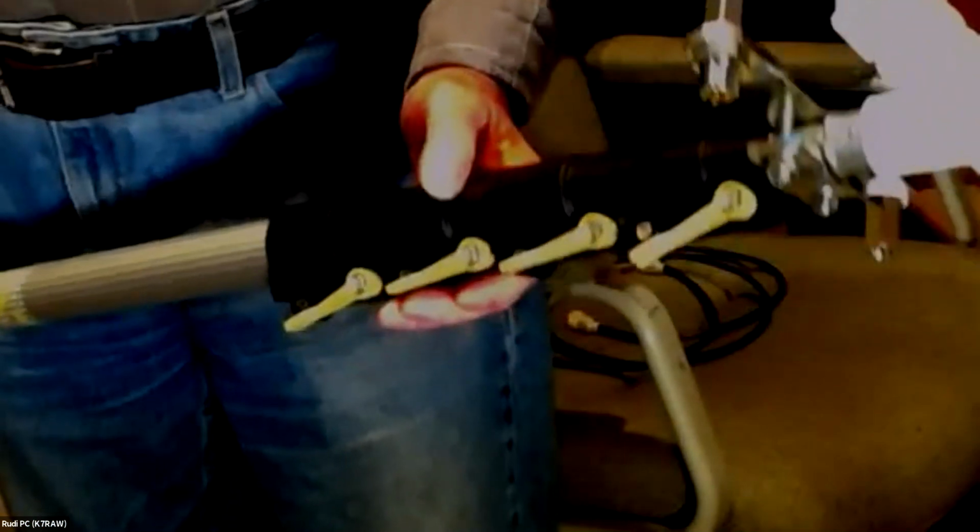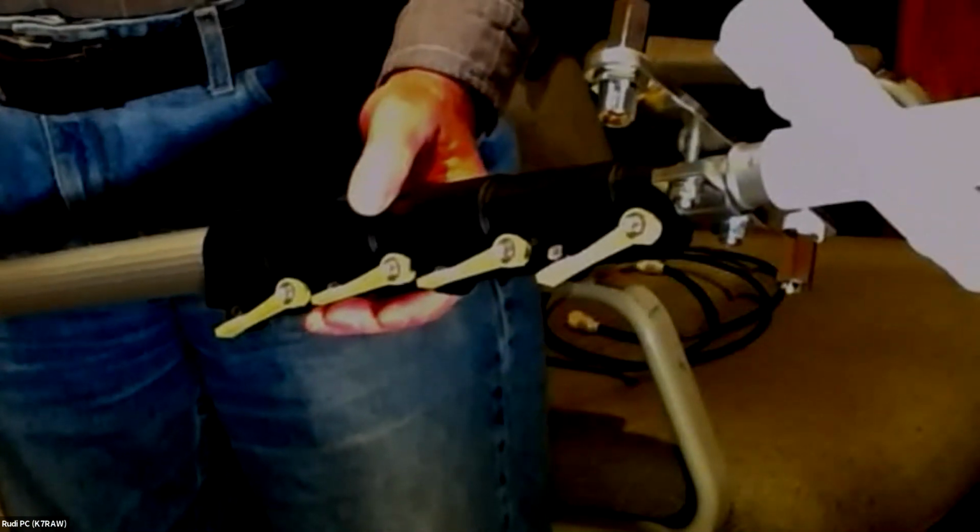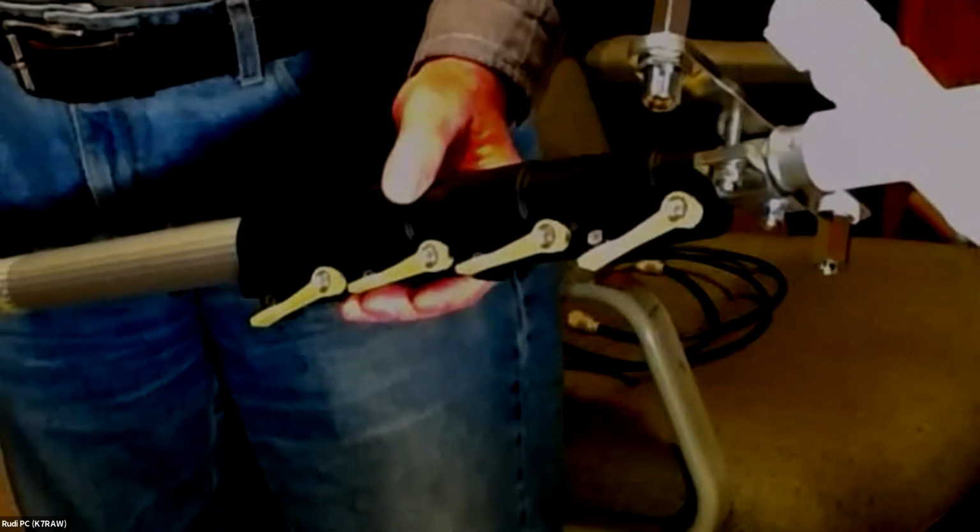If the sections make contact, that could be a good thing. Certainly a temporary thing you can put up at night and take down before you're done operating. What's interesting about it is that when you push it up and down, assuming it's not resonant but conductive, maybe as you go up and down, it's going to change the length of the antenna. Maybe. Well, yes, absolutely, it would, if it's conductive between the sections.